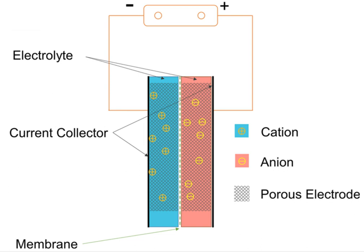In applications often only the switch-on and switch-off range is interesting. The internal resistance R_i can be calculated from the voltage drop ΔV2 at the time of discharge, starting with a constant discharge current I_discharge. It is obtained from the intersection of the auxiliary line extended from the straight part and the time base at the time of discharge start. See picture right. Resistance can be calculated by R_i = ΔV2 / I_discharge. R_i = ΔV_2 / I_discharge. The discharge current I_discharge for the measurement of internal resistance can be taken from the classification according to IEC 62391-1.